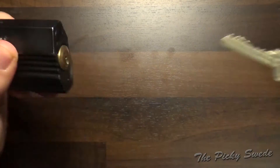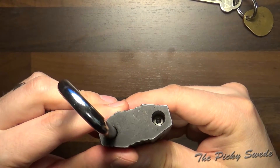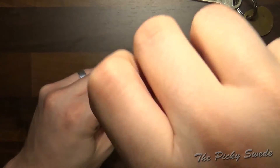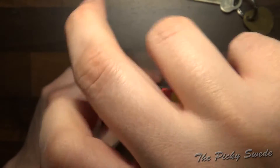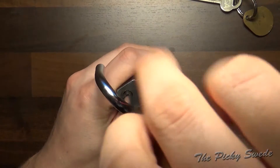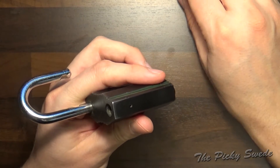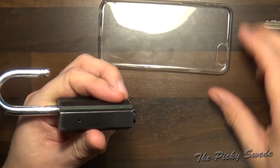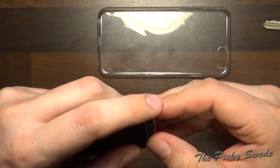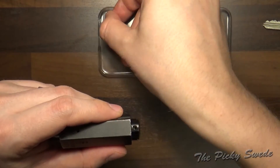You have to lock it with the key. To take it apart, you need to open it, remove the key, and there's a little screw in there. It's a Pozidriv screw but my Phillips driver will do just fine. I'm removing this screw and pushing the core out with the driver. I noticed I need some makeshift pin holder, so I got this old iPhone silicone case. The springs are on top of the core here, so you have to take out one spring at a time.